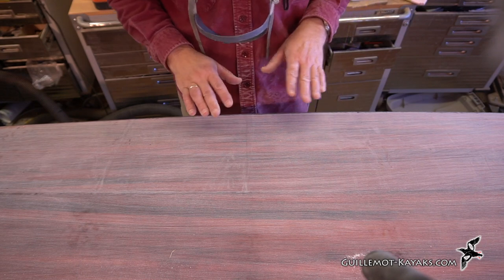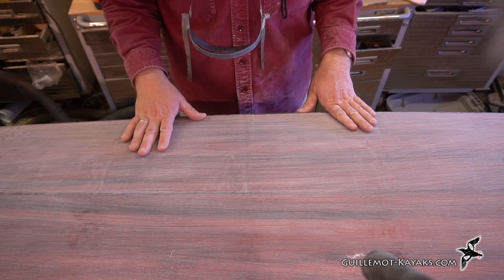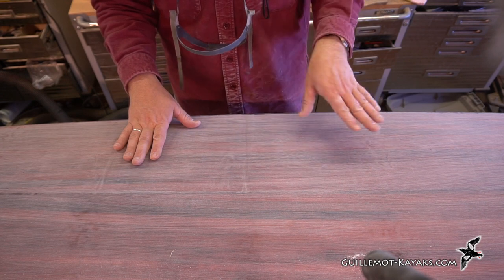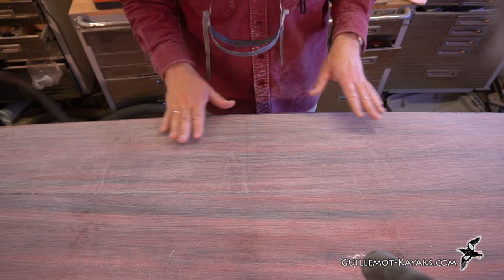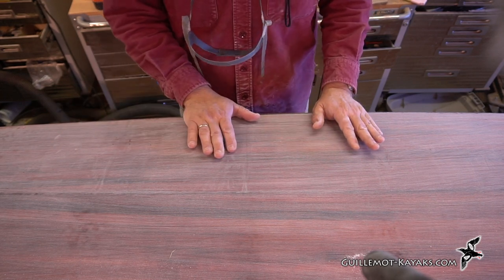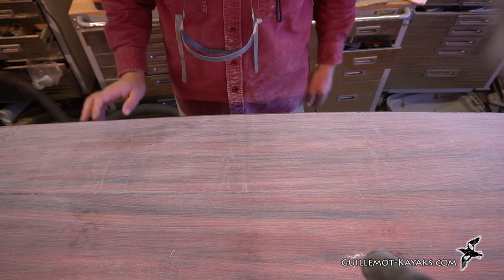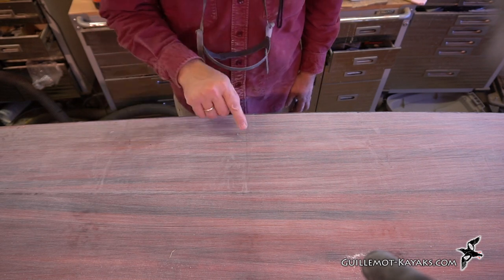You also notice that the initial sanding goes really quick, knocking off the high spots and getting it 90% of the way there, because basically you're not sanding that much material at that point. You're just knocking off the high spots, so the amount of work being done is just in those little spots where it's sticking up. As you get down to the point where you're really close to done, now you're sanding the whole surface, so the whole sander's working, and you've got to take that whole surface down to the level of the lowest spot. So it takes longer.